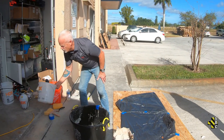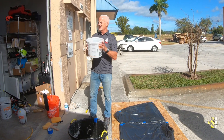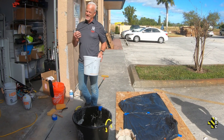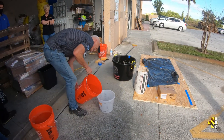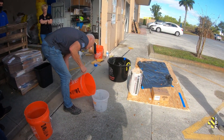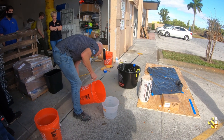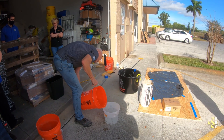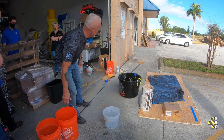Water — if I'm doing big overlays, I want to be exact on my water every time. So what we're doing today is 1.5 gallons, which is our standard high water overlay mix. The nice thing about knowing exactly what water is, it makes the mixing process super fast. I don't have to slowly add water to get the right consistency — I can add all the water at once, and the mixing process is super fast.